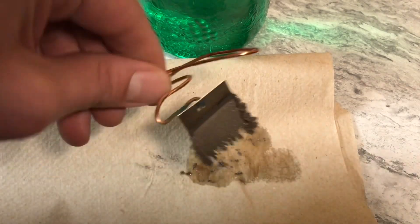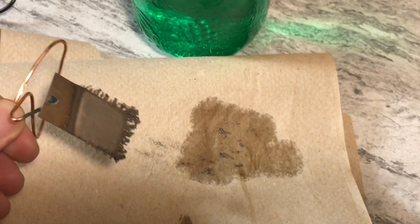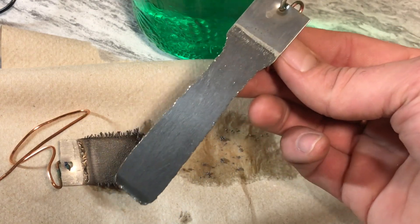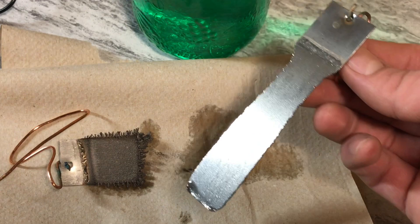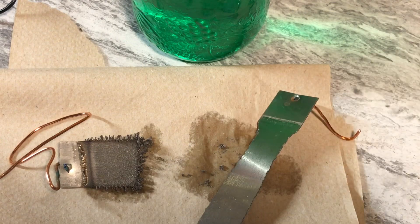Now I'm detaching everything and cleaning off the electrodes. That's what they look like after two hours — just pieces of nickel that stuck on. I'm going to clean them off and get them ready, because when you go to plate you still want to use the same cathodes and anodes. Look how much the nickel strip has been eaten down compared to what it was before — that's all gone into the solution. That's how you make your nickel plating solution. I'll have nickel plating videos ready next. Take care, hope you enjoyed — leave a comment and let me know what you want to see.